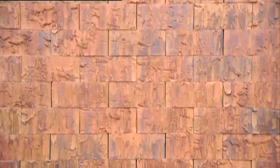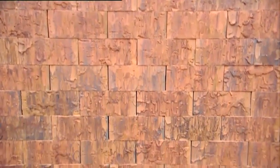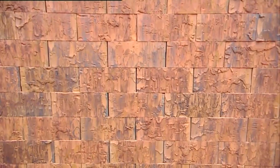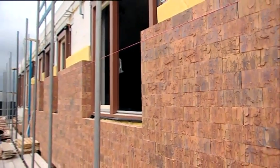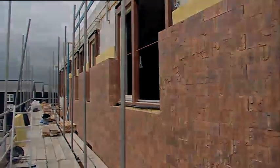The stacked click brick facade shows small, open vertical joints between each brick. It is important that the vertical joints in the applied facade are, as much as possible, of equal size.